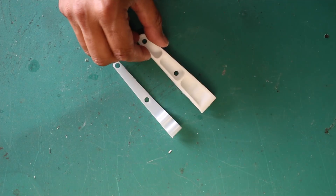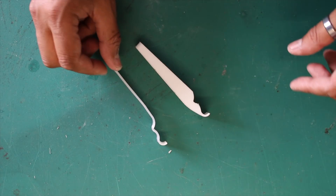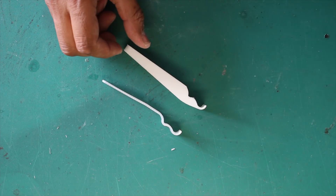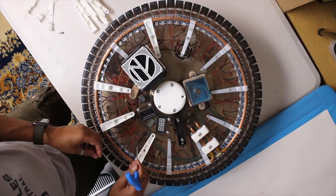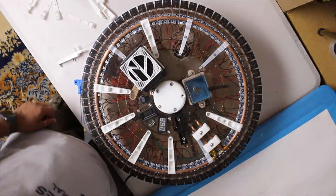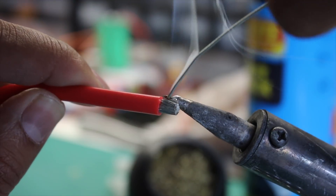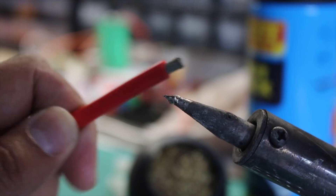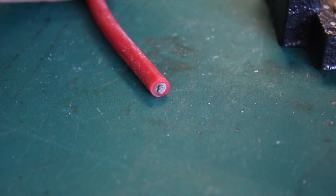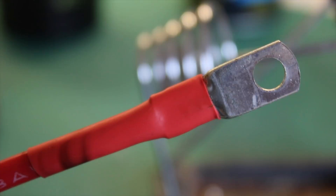I've also modified the pipe retainer clips as I found the current ones are too flimsy and unable to provide enough downward clamping force on the heat exchanger pipes, especially when the pipe starts running hotter. The new design is much beefier and more substantial with improved structural elements to make it more rigid. Beyond that, I also recommend using a heavy gauge wire — so I upgraded my 14 gauge to a 4 gauge with much higher rated terminal ends that are crimped, soldered and heat shrink wrapped for additional precaution.